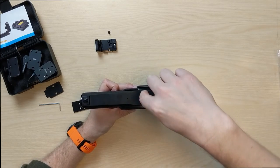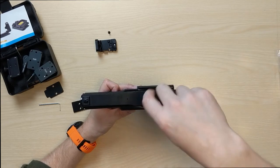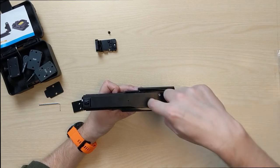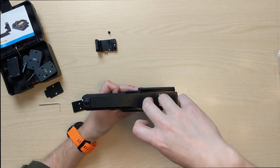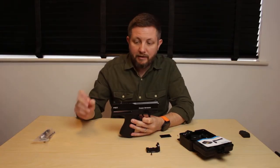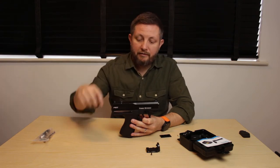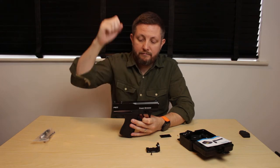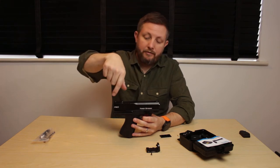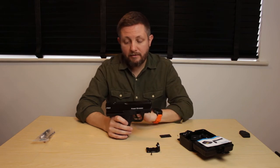I was quite careful that as you get to the bottom, you don't want to keep forcing the tap bit round and round and round, because this is aluminium and that is hardened steel, I believe. So once you get to the bottom and you feel that it won't go any further, don't try and get another quarter turn out of it like you were tightening up a nut or something. Get an eighth of a quarter of a turn, because what will happen is it will just shred that thread out. It will just keep trying to overthread it and it will just rip it out. So when you hit the bottom, stop. And then you slowly wind it back out again. And then you have to test your tap.